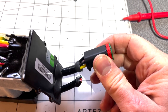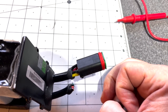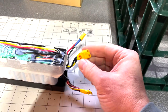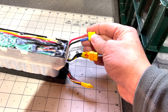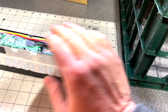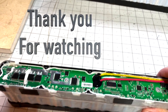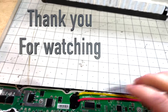Always check that there's no power coming out — safety first. I used XT60 connectors here, and I soldered those connectors to the wires before enabling the power output. I'm debating whether on the next one I'll add a way to turn the board on and off.